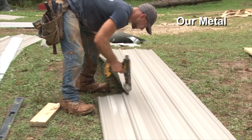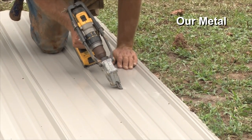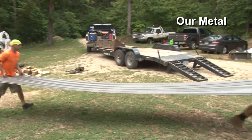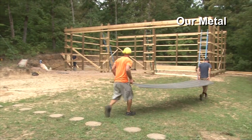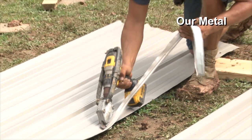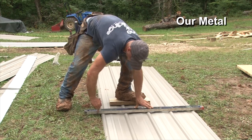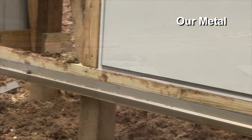Our standard pole barns are going to be 29-gauge metal. Why 29-gauge? We're building with lumber frame — all of our wall girts and roof purlins are going to be on two-foot divisions. That's a lot of connections and a lot of screws, and ultimately that's going to be stiffer and flex less than a commercial steel building. We also offer as an option 26-gauge metal. Eight-foot center roofing will use 26-gauge metal. Sometimes we have equestrian barns where horses are going to kick it — it's not uncommon to have a wainscot around the building where just the wainscot is a heavier gauge. Sometimes people are worried about hail damage. But we can do 29-gauge or 26-gauge metal at a slightly higher cost.